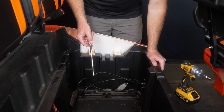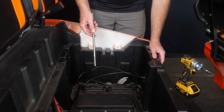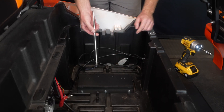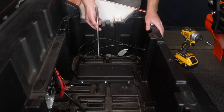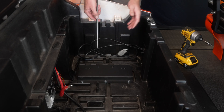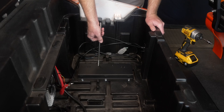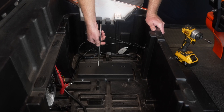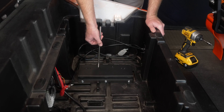The first battery we're going to cover is our 51 volt 105 amp hour through-hole battery, which utilizes a single bracket and our center rod. We can select either of the two holes here to put our center rod in, which will adjust the battery to the front or back — it does not matter which one you use. I'm going to select the rear hole. Thread the rod in about half an inch for now and we can make adjustments later once we install the battery.